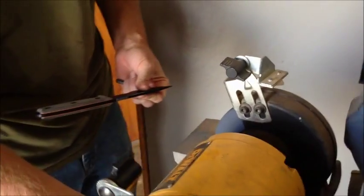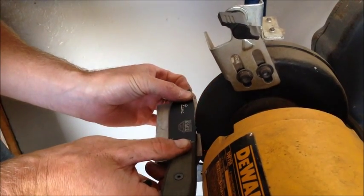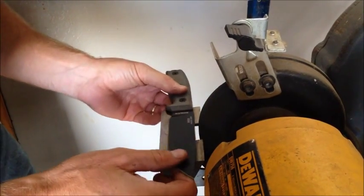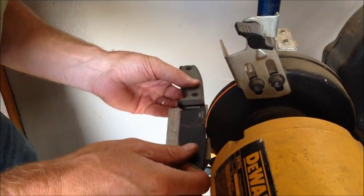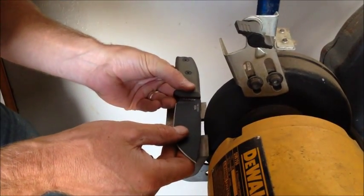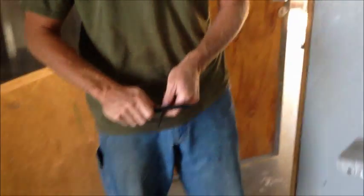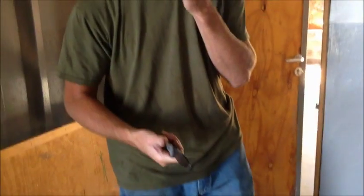So now I'm going to take and put this on the grinder and show you guys. I'm just going to start with it on both sides, just because it's easier here. This only takes a few minutes, and you want to make sure you keep your blade cool — always have some water nearby, dip your blade in, it's not going to hurt anything. As you guys can see, it's coming along nicely. Let's just see how this throws sparks now, just from a couple hits on the grinder. Just raking them off — that's all it takes, just a few minutes on the grinder.